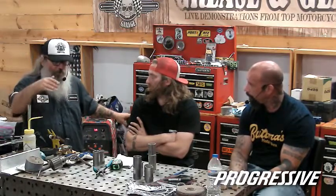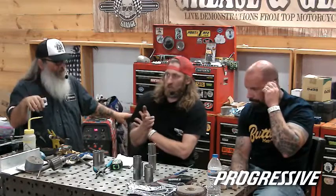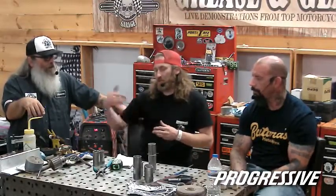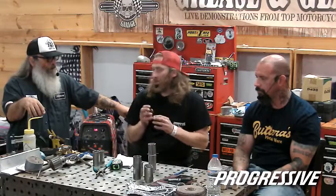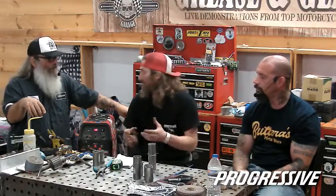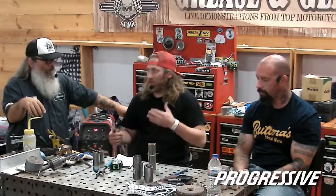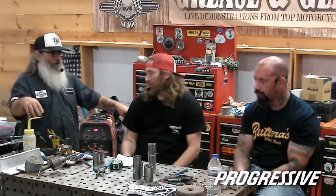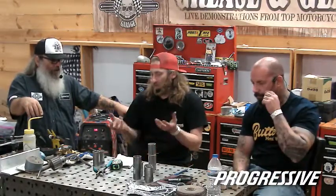Yeah. That start and stop factor, like we're saying, looking at your welds and looking at Austin Welds and some other people out there. What's your procedure for your stops and starts, keeping that heat the same all the time, keeping your movement the same? It takes a lot of practice. Like we were talking about, the part gets hotter, so it's going to take less amperage than when you started halfway around the part to get that size ripple. So it's always good to start slightly ahead of the last dab, get it starting to melt, back up into the weld, and watch how big the circle of the focus of the arc is, and then you can start running. It just takes time of looking behind your torch, because another thing is your hands, your speed, your eyesight, it's what you're focusing on. Because a lot of times you're looking at how high your tungsten is or where your rod's at. Once everything becomes second nature, I don't even worry about where my hands are anymore, really.